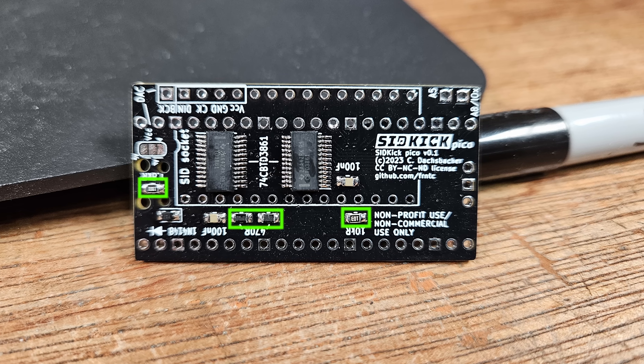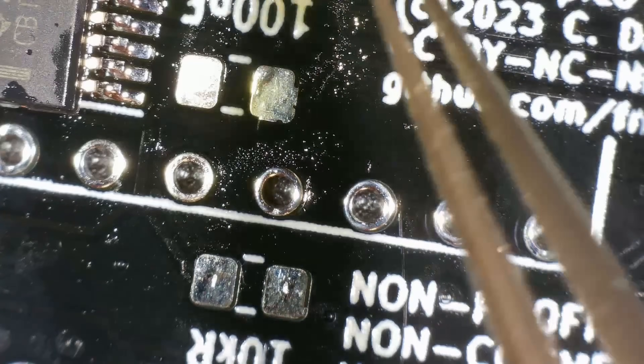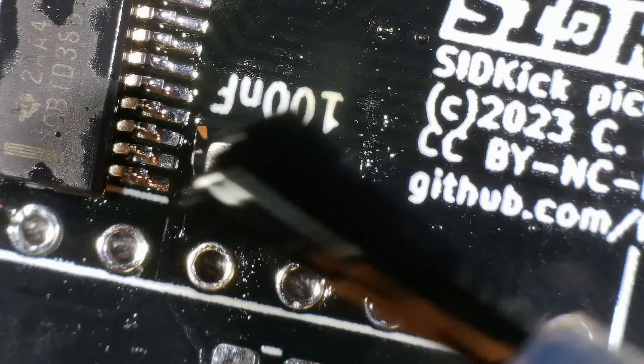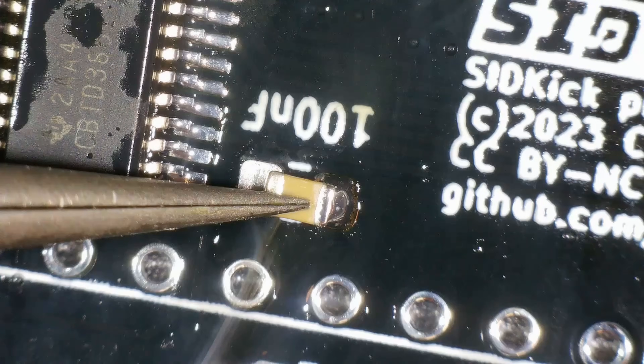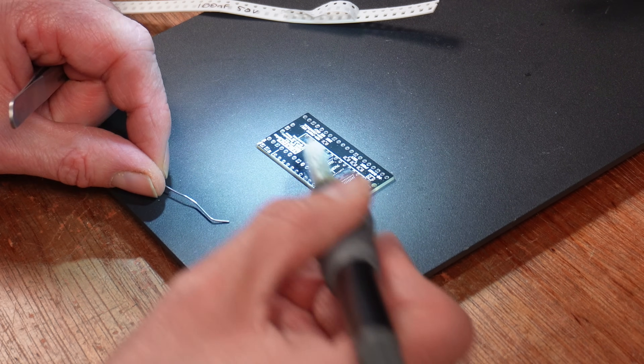Now the chips are in place. I need to install the resistors, a couple of capacitors, and a diode. These are 0805 parts, which means they are 0.08 by 0.05 inches — or in post-1960s measurements, 2 millimetres by 1.25 millimetres. That sounds small, but with a good set of head-mounted goggles I find these pretty manageable even without a microscope. Using tweezers I get the part roughly into the right place and dab a drop of liquid flux onto it — I tried with the flux paste but that makes everything too sticky and the capacitor would just stick to my tweezers. I move the component into the right spot and then with a tiny touch of solder on my iron, while holding the part in place with light pressure from my tweezers, I touch the solder to the pad and component on one end, then before the flux evaporates do the same for the other end.